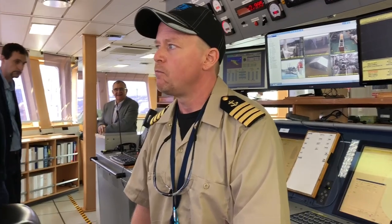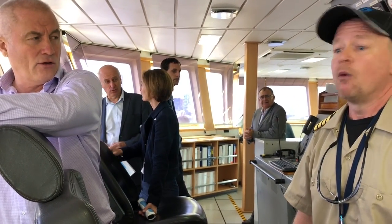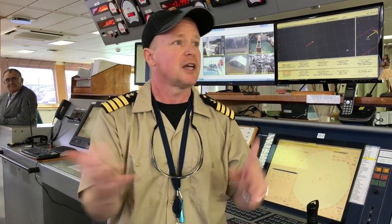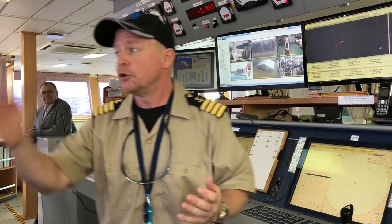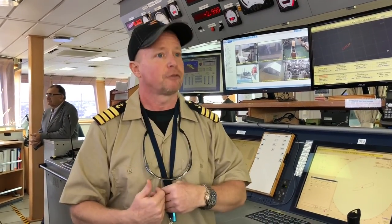And if you're in a force 12 storm and it's coming in on the side, on the starboard. That was a great question. If the seas get really bad, then we buoy off or we stream and we leave. If it's going to be a typhoon or a hurricane, depending on where we're working, we don't stand by for that. We'll stand by for 45 knots, certain things that you can't do cable in, and we'll stand by for. But if there are typhoons coming, you then stream off or buoy and the vessel gets out of there, and then we come back after when it's safe.